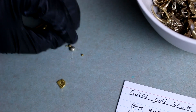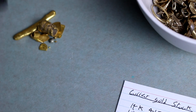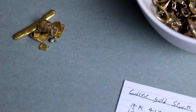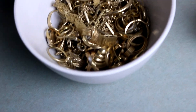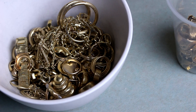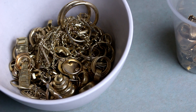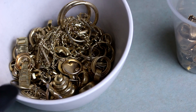I'm actually going to refine these separately because as they are, they'll dissolve in the acid right now. This stuff over here I will have to treat differently. Anything between 6 and 18 carat is insoluble in either nitric or aqua regia. So in order to remove the silver, I'm going to have to add more. I put out a video explaining this earlier today — I'll put a link in the description so you guys can go watch it.